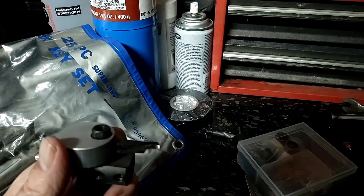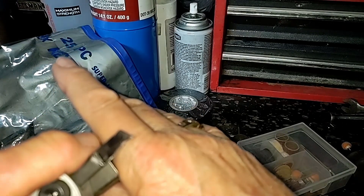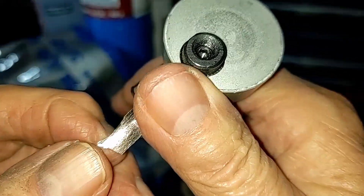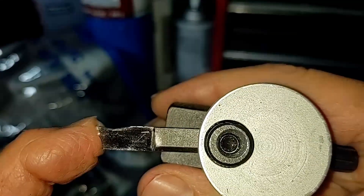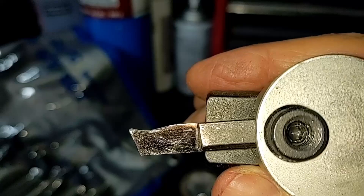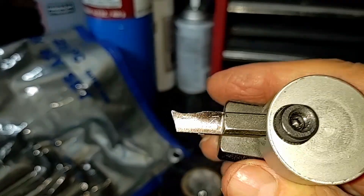Let me turn on the light here. That's now been ground a bit — I know it's kind of hard to see exactly what's going on. We now have a hook that should actually cut into the aluminum. Time will tell, but it's certainly better than what was there. So let me put it all back together, stick it in the drill press, and see how badly this chatters. See you in a bit.